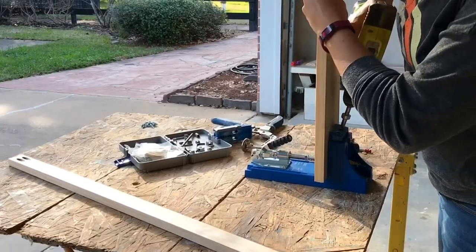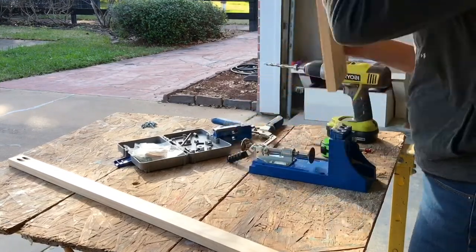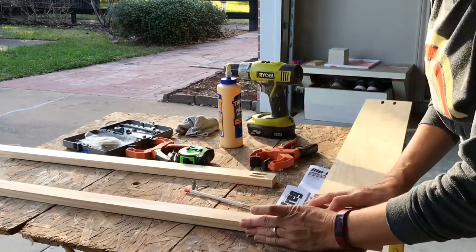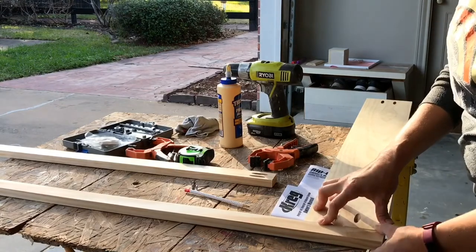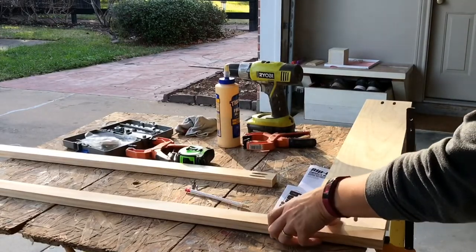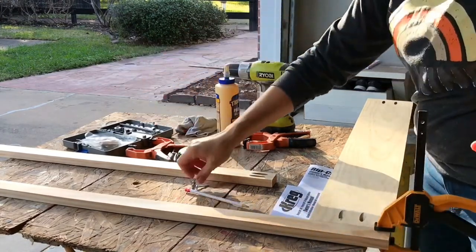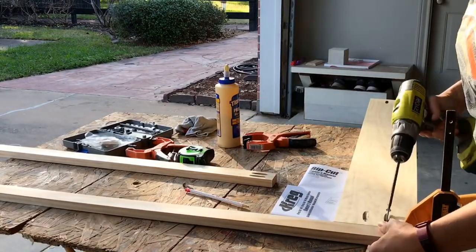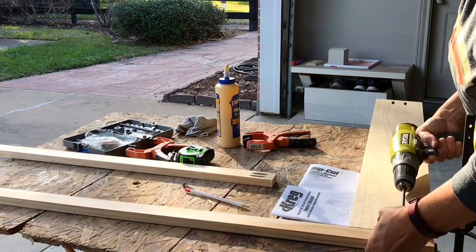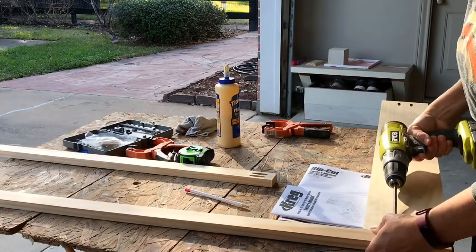Once that was done I was ready to make and attach the face frame for this upper cabinet. I originally thought I'd use pocket holes to assemble the entire face frame in the garage, then move it in and attach it all in one go. But pocket holes can be a pain — no matter how well you clamp and line things up, pieces can shift when joining, and every time I tried it I ended up with about an eighth or sixteenth of an inch difference in the lineup. I wanted the face frame to be perfectly flat, flush, and looking like a professional built it.